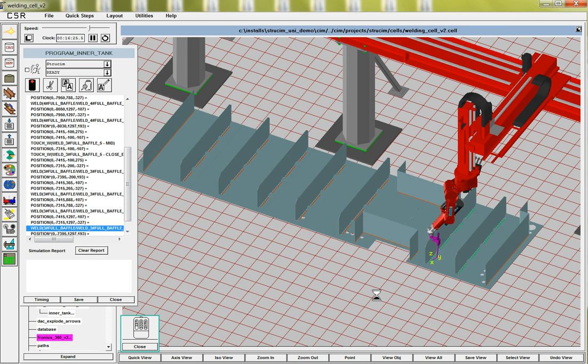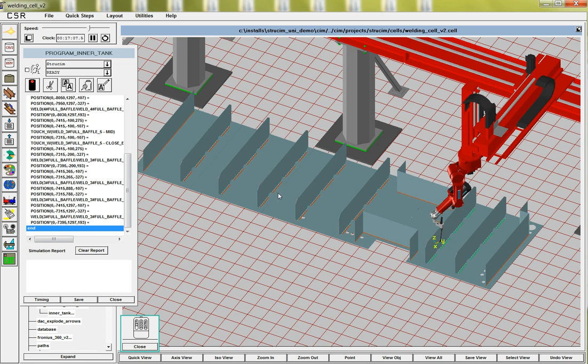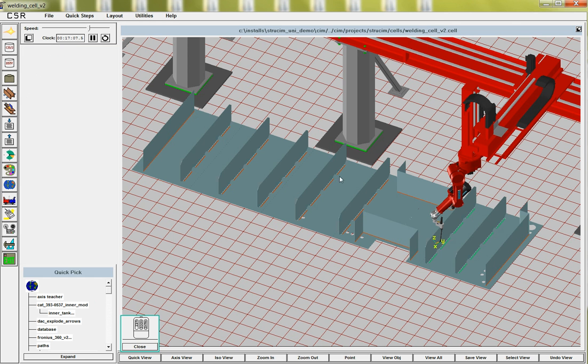Okay, I think that kind of wraps it up. It's kind of an overall demo of how we convert a solid part into a family of weldable subparts, and we take some of the parts off because we don't want them. They're not going to be on this welded part. And then we look for the characteristics of each part. We find the welds, and then when we plan the welds, then they're in for the next time.